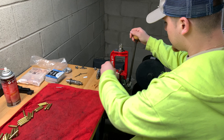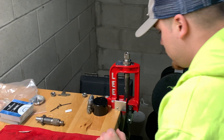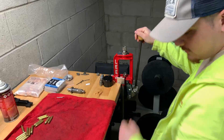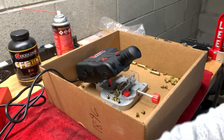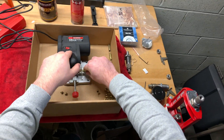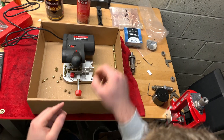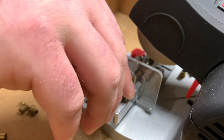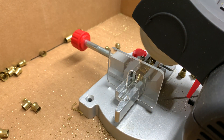What we were doing here was, after we sized the casings in the lead press to 300 Blackout spec, we got out this little mini saw here and we were cutting the casings down to the 300 Blackout length. Now, this isn't the last step we did to finish this case — you'll see in the next video.